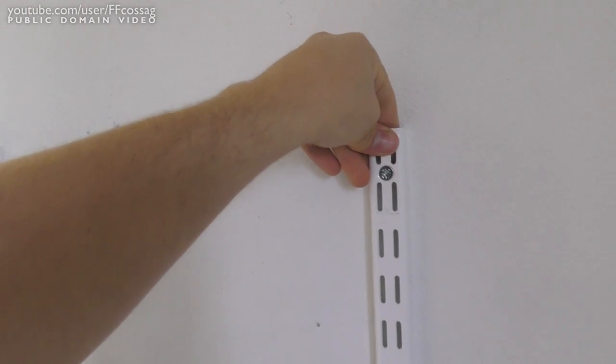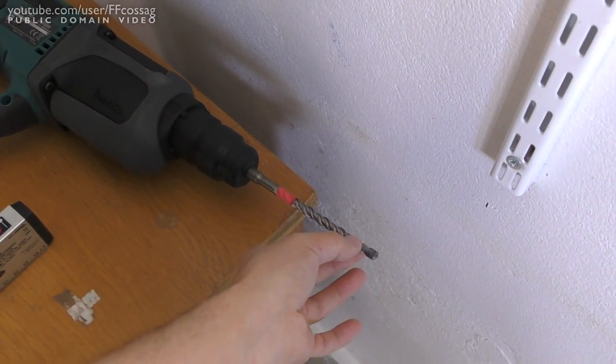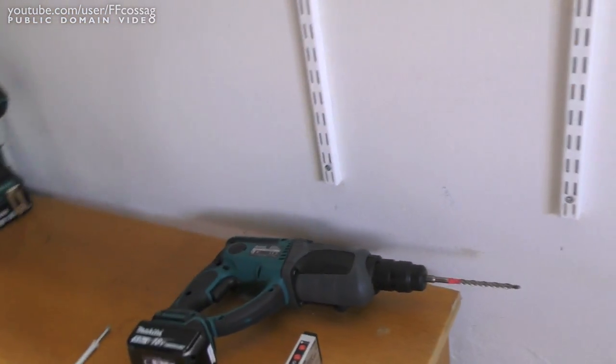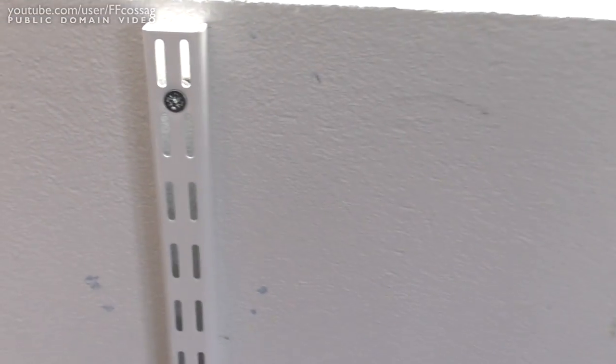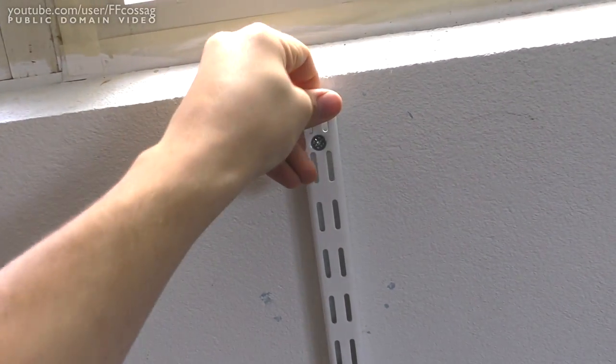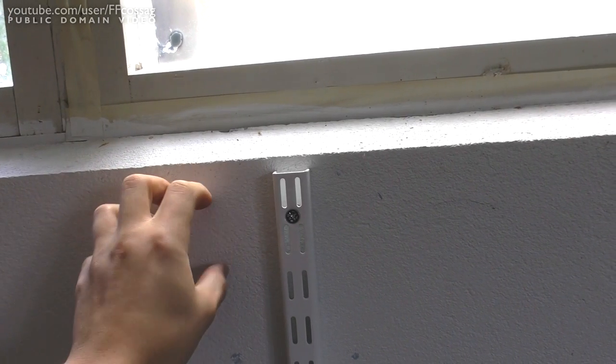The remedy is that I'm using a proper SDS drill now, which makes much tighter holes than the old hammer drill. I'm thinking I'll be able to make holes that actually fit the screw inserts. I am using plastic inserts — that's just because nothing else bites in these walls. You cannot use a concrete screw or anything; it'll just rip a chunk of wall out. It's just ridiculously soft material.